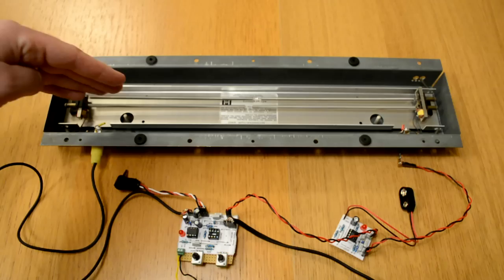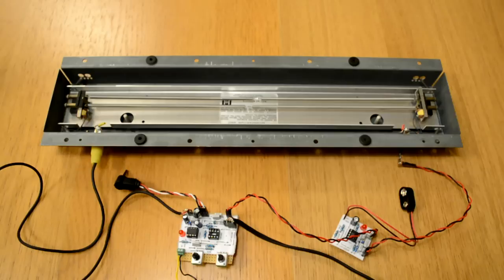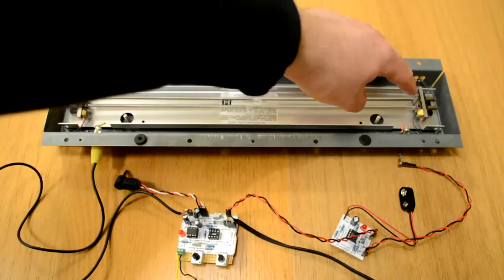This movement propagates along the length of the springs, bounces back and forth, in fact bounces all over the place because of stiffness in the springs. And that results in thousands of delayed copies of the original sound wave that can be picked up, for instance, over here, again using magnets and a coil, and amplified and mixed back into the original sound. So it's hooked up and any movement of the springs is converted into sound.